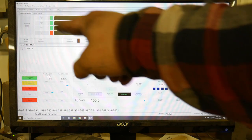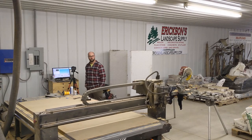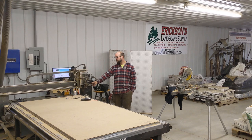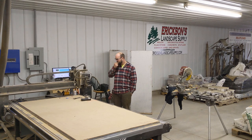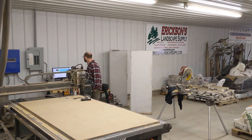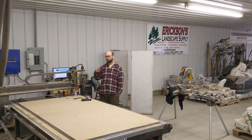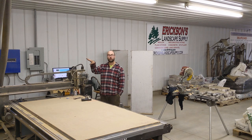Tool three is in the machine, so we'll do a tool change M6T2 and hit cycle start. It tells me to turn off your spindle — mine's off, hit OK. It moves all the way over to my tool setter location, rapids down, and slowly probes the tool setter. Now change the tool to an eighth inch compression router bit and press OK when done. When the spindle came back up after probing the tool, it moved over — I did that because sometimes the tool will fall out and I don't want it hitting the tool setter. You can also adjust that in the macro and have a tool change location wherever you want on the bed.